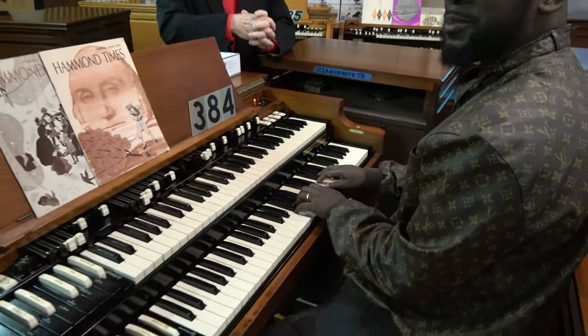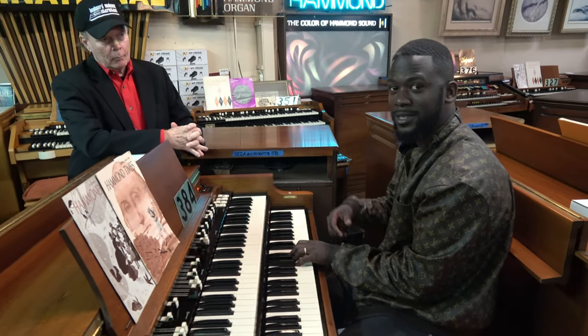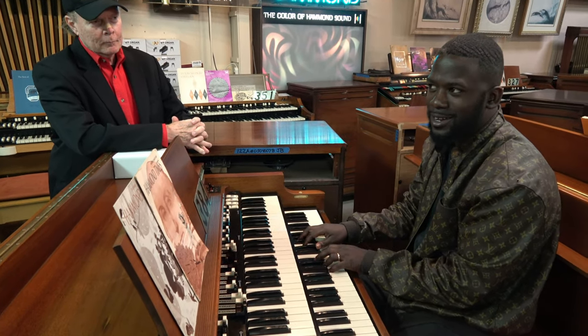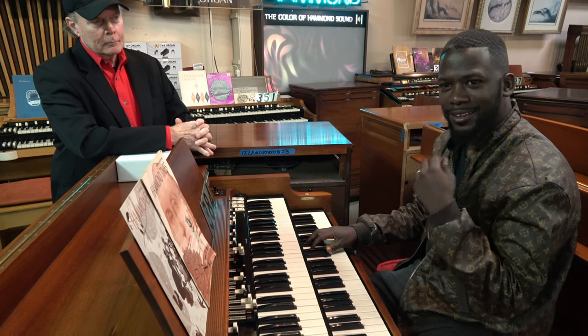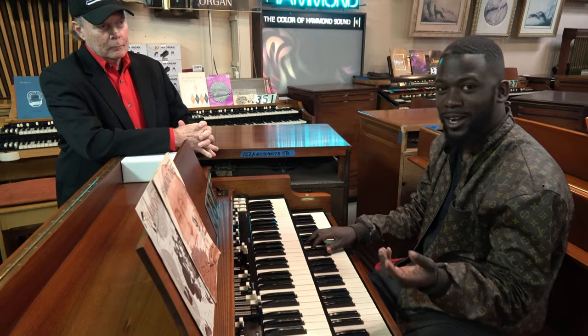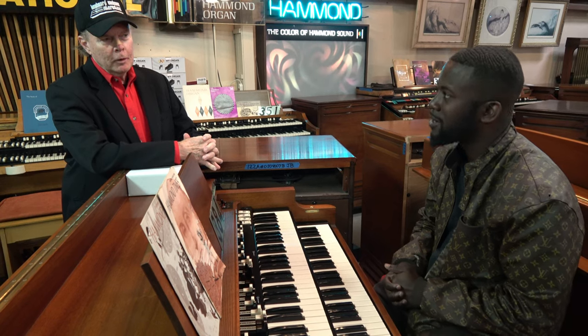Well, it's a must. I look at it as a necessity, because without removing the foam from the keyboards, over time, that foam deteriorates and destroys all the wires — if not all, some wires associated with the keys on particular drawbars. There are a lot of fine wires in each keyboard.